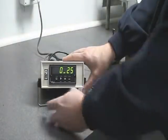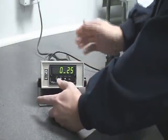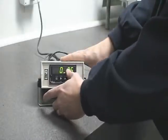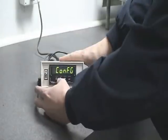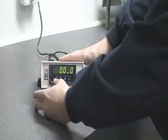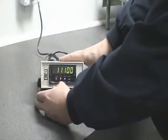This is automatic mode. If you already know your coordinates — your low and high inputs — then you would set it to 15 and manually input the low end and the high end. Config should be all zeros. Filter should be 11100.